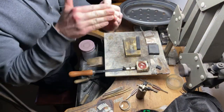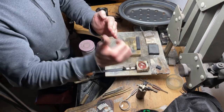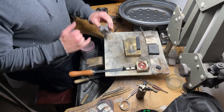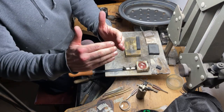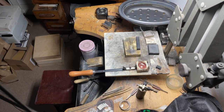I want to do these a lot, way more than I did the ones before. What I really want is to get the corners of the ingot meeting like that, because where the cracks and the porosity tend to be worst is along that hexagonal, it's octagonal when they go through the rolling mills. It's in the crease where it's worse, which I think is because quite often there's a rounded-off edge and it doesn't quite get peened. That's what I need to focus on.